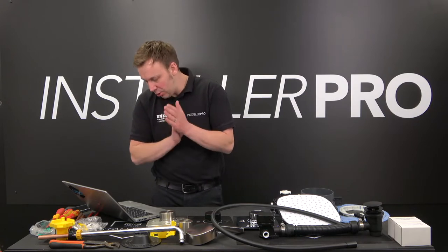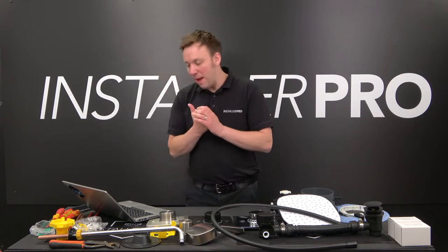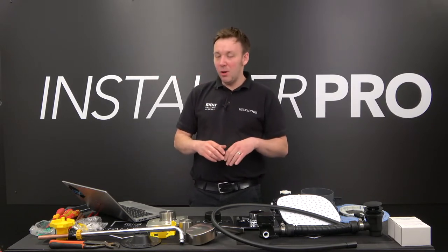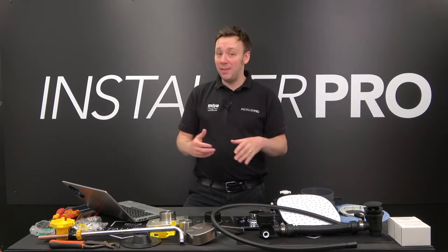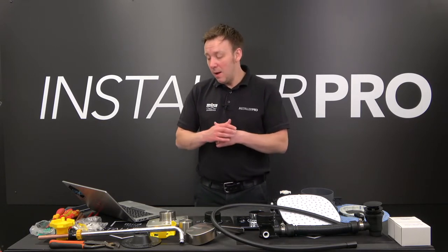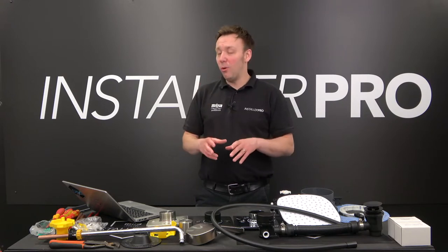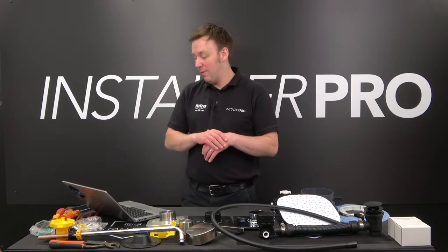So, a question from Sean Hanlon. I have a customer who wants to replace their Aqualisa shower that has controls on a metal bar which hangs from the ceiling. The control unit is in the upstairs bathroom under the bath. What's the closest replacement? Some of you will remember that a while back now we released our Mira Activate digital valve. The Mira Activate digital shower is a direct replacement for the Aqualisa Quartz, which I think you're talking about there, Sean. Even the screw holes for the slide rails, which drop down from the ceiling, are in exactly the same place as well. So you should be able to leave your drill in the van.